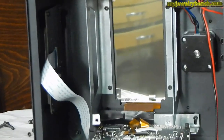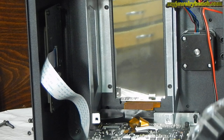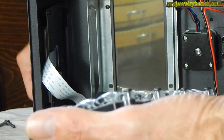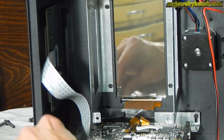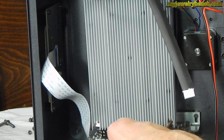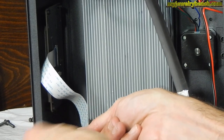For the next step, we're going to actually mount the LED array. The motherboard is on one side of the printer, so I'm going to mount the array so that its cable is on the opposite side from the motherboard. We're also going to use the four remaining medium screws that came with your kit, so make sure you have those handy. Get your screwdriver ready and tighten them until they're tight.